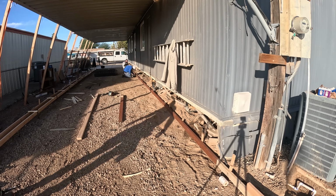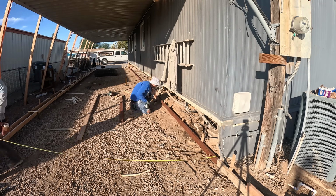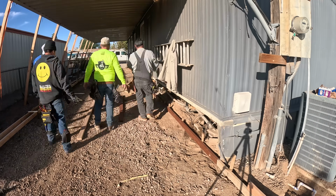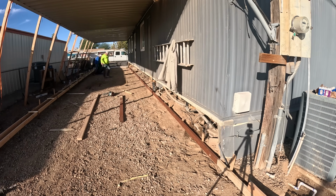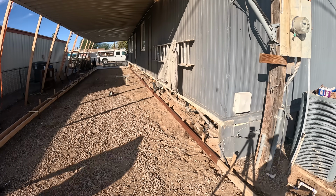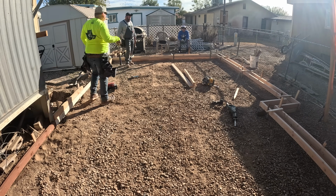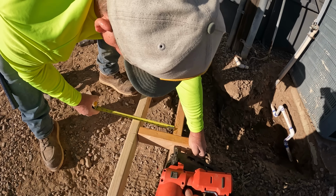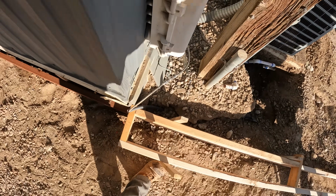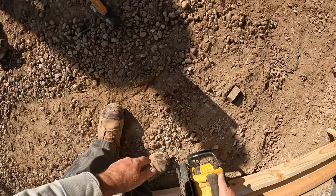But there's your stem wall right there, how it's going up. We got a double stack 2x4 in the back and then a single hanging, so it'll be a monopour. Also, I'm going to stab some anchor bolts into that whole stem wall to fasten a plate. So on the box outs for the stem wall, for the cross slope drainage through the stem wall, that's just a matter of the last minute. Once it's all set up, then we can set the inside box outs for cross slope drainage. And the plate will just span those little 6-inch box outs.